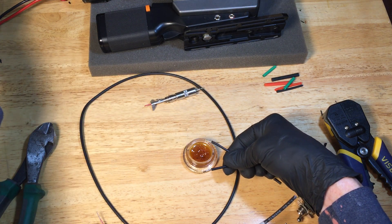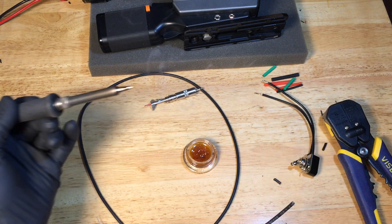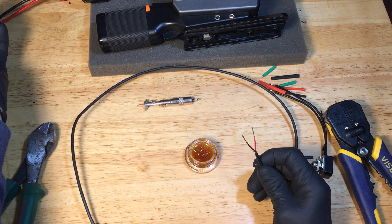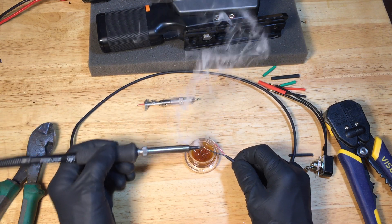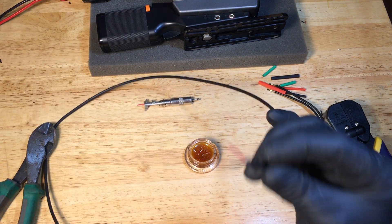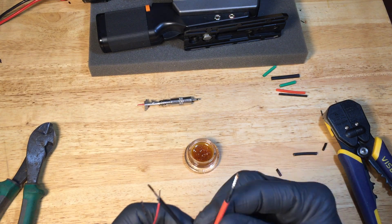The solder is just drawn right into the strands of the wire. Both leads are prepared. I dip them a little bit in the gooey stuff — this is rosin-based flux. Don't make the mistake of getting acid flux, which is for plumbing, because if you use acid-based flux on your joints it'll eat up your wires and cause a corrosive effect on your solder joints. There are two kinds of flux and this one is rosin-based, which I believe comes from trees. So here are our two tinned leads.